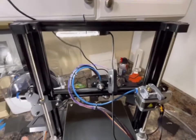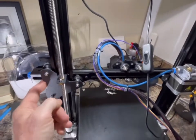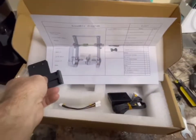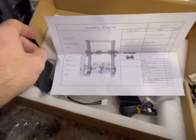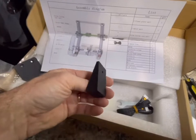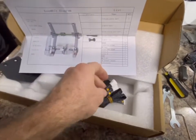So we've got our hardware done. Let's go through a quick mental checklist — everything's tightened up, wheels spin freely, nuts are tight. Now all that's left is the wiring. One thing to note: this kit comes with some extra brackets that appear to be for an Ender 3 with the power supply off to the side. Ours is built into the Ender 3 V2, so you don't need those parts. The kit does give you a wiring harness and a Y-splitter, which we're going to use to connect the motors.